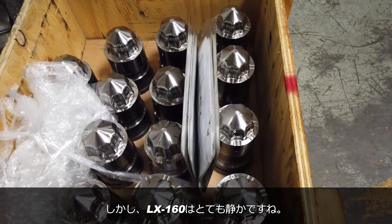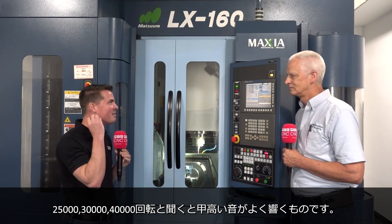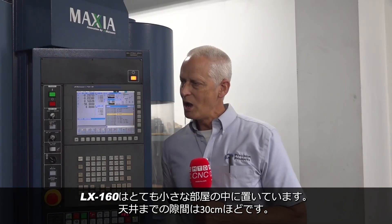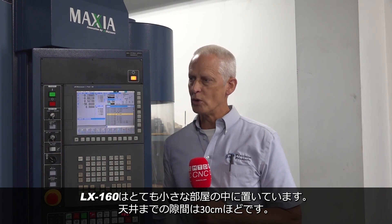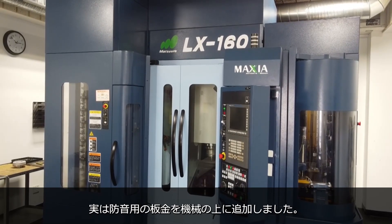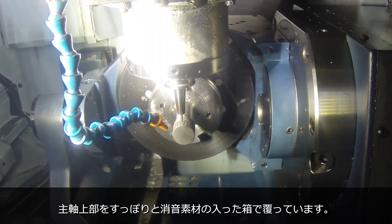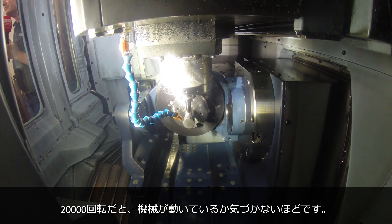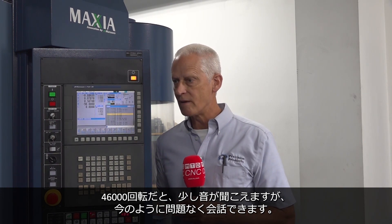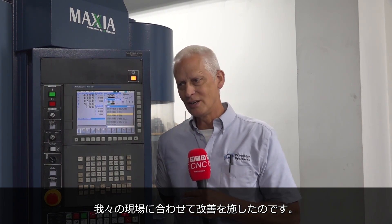This thing seems really quiet. When I think of something running 25,000–46,000 RPM, I expect it to be pitchy like a dentist's office, but I'm not hearing that. What's unique is we have the machine in a very small room with only about a foot of clearance above it to the ceiling. We actually added a soundproof box to the top of the machine, encasing the top of the spindle in a box with sound deadening material. At 20,000 RPM you don't even know it's running. At 46,000, you'll hear a little whine, but we can stand here and talk without being annoyed at all.